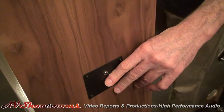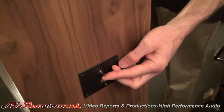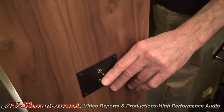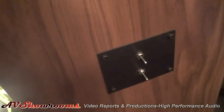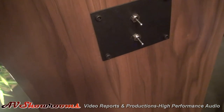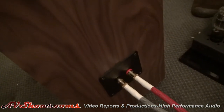It's really more qualitative than quantitative. Okay, this is definitely quantitative. This is all quite measurable. In fact, what I'm doing here, I don't mind saying, is selecting among different materials that have a different sonic character: carbon films, for example, versus a carbon composite, two carbon film resistors that I'm selecting, versus non-inductive wire wounds, and then there's a third one.